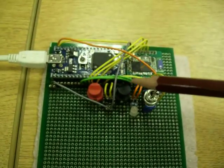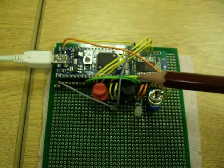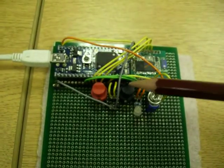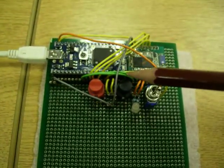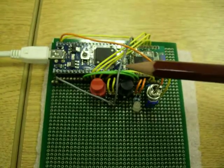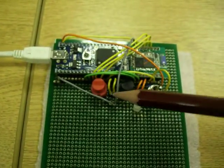This yellow cable is needed to control the Bluetooth mode from AT command mode to the data transparent mode if you are in master mode. If you are in slave mode, it is used for publishing the SPP profile, and if a remote device was discovered and you still want to disconnect, you can send this to disconnect.